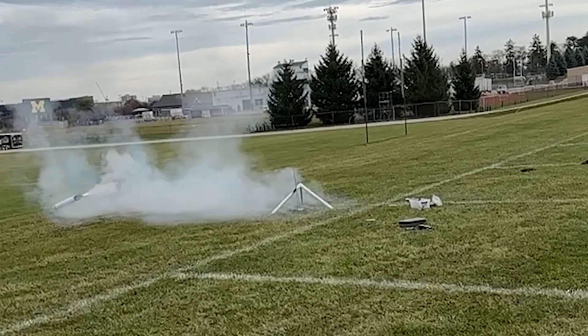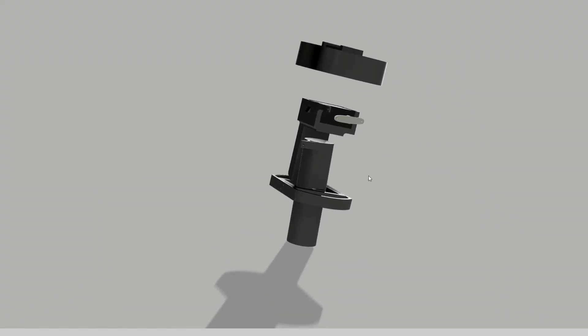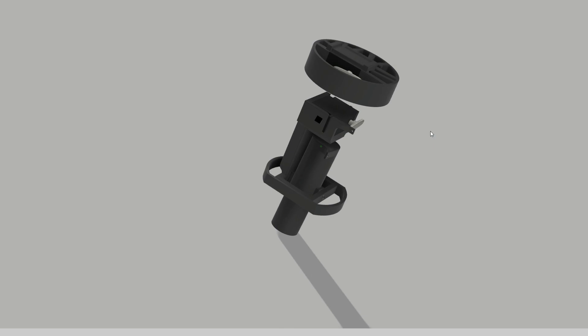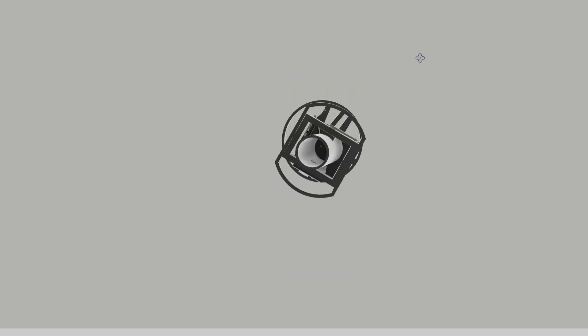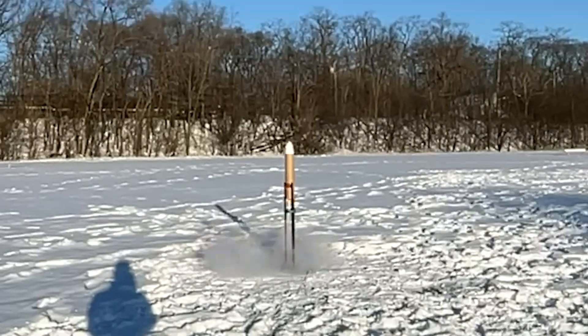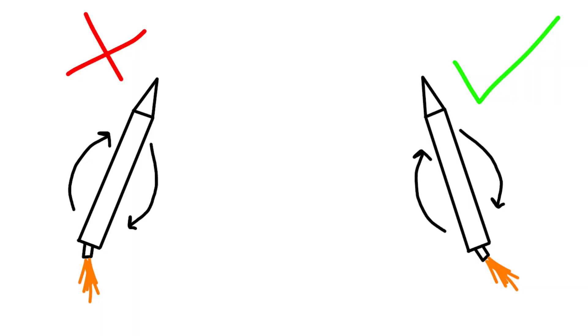After making more improvements, I created the fourth iteration of the design. It was better than the previous designs, but still not perfect. This was where I started to have some success — the design was small and effective, giving me great control over the position of the gimbal. The rocket spun out of control during the fourth flight, although after analyzing the video, I caught the board correcting in the wrong direction. I originally had it in my head that we wanted the rocket motor facing down as much as possible, as we wanted the rocket to go up — it made intuitive sense to me. Instead, what we needed was to correct the opposite direction, rotating the rocket back upright. With my current code, the gimbal was actually making the situation worse.